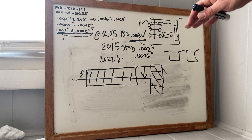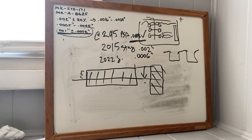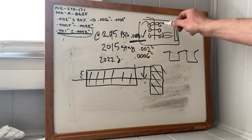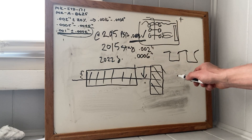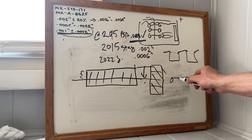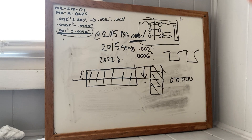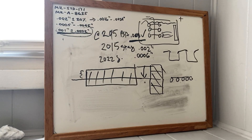There are things that affect the process. The deeper in the tank the parts are, the thicker the coating. So if you want to control it precisely, you want to rack horizontally — you get fewer parts in the tank. That's for high-precision applications, coat to size, aerospace-type parts.